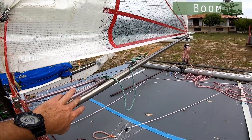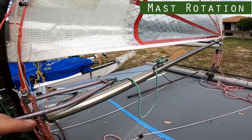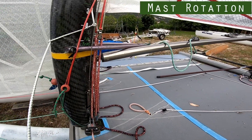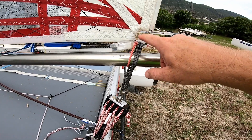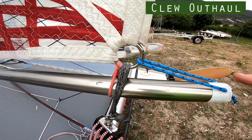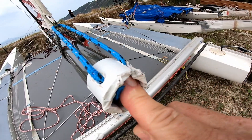Moving further backwards, the boom gives support and leverage to the bottom of the sail, making it easier to sheet in. Attached to the boom on this boat is the mast rotation system — a negative system which restricts the mast from rotating. Other boats might have the mast rotation system at the base of the mast, which makes it easier for trimming while on the trapeze. I've got two lines on this boat: one is an extension onto which the main sheet system attaches, and the other is to keep the sail tight to the boom. Pulling the sail to the back of the boom, we have the outhaul system — on this boat just one line that goes through the clew of the sail, and that knot locates into a groove at the back of the boom. Very simple, and I never find any need to adjust it while actually sailing.